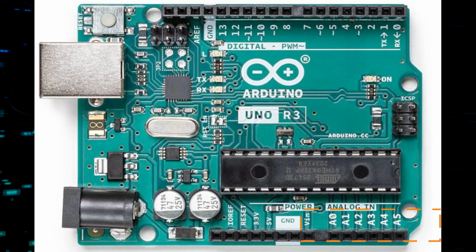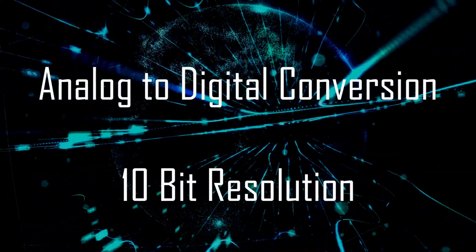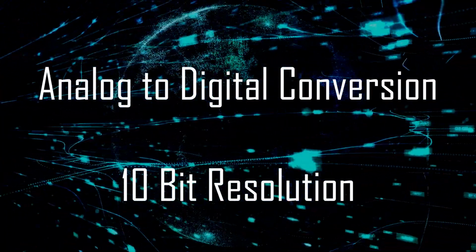The Uno has 6 analog pins that can also function as digital inputs or outputs. These pins are A0 to A5. The board utilizes an analog to digital converter with a 10-bit resolution so it can represent a digital value between 0 and 1023. The pins measure from ground to 5 volts, but you can change the upper end of that range with the AREF pin and the analog reference function.